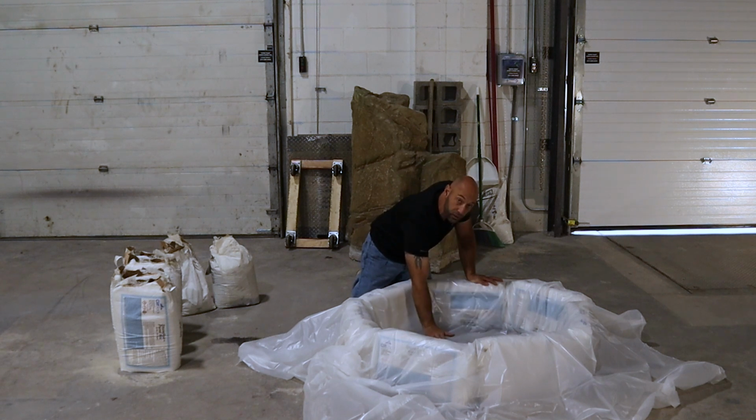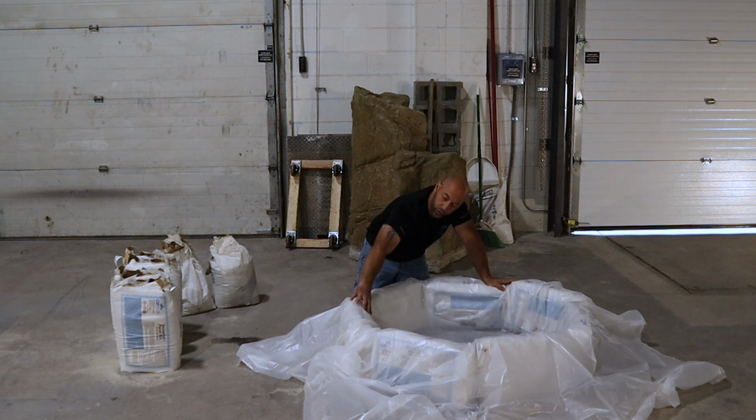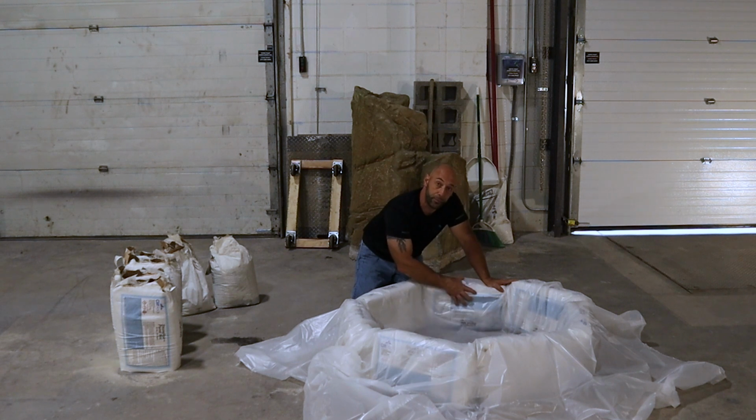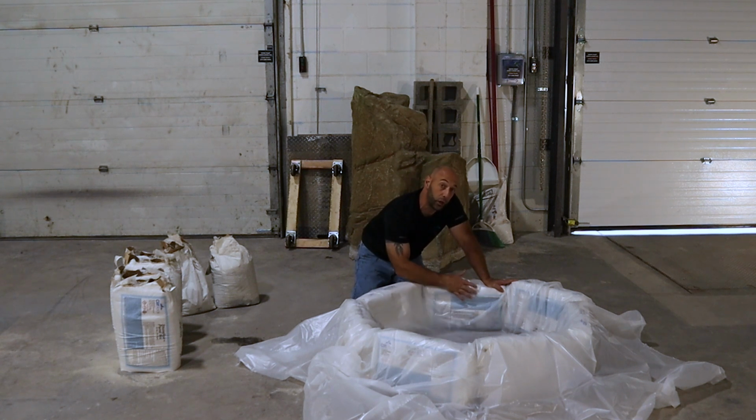But it'll be nice because when we do pour the concrete in, the stone rock, you're going to slurry it up the walls and just keep bringing it all the way up so your walls are going to start to tighten up and stiffen. That'll create a foundation or a scratch coat. Then we can put our second layer down because it'll have something to grab onto instead of sliding down the plastic all the time. You never want to release this either, because that's going to make it even harder for the concrete to stay up on the plastic. You release that, it's just going to keep sliding down on you, and you get frustrated. So just normal plastic and that's it.